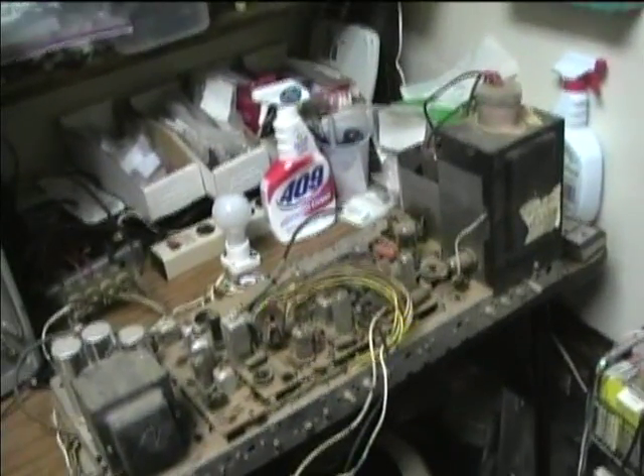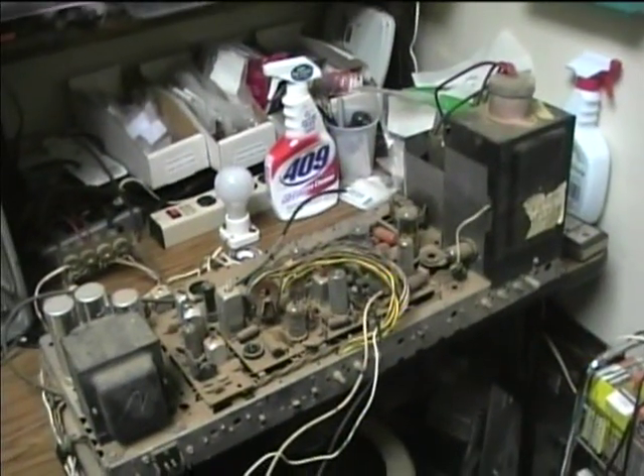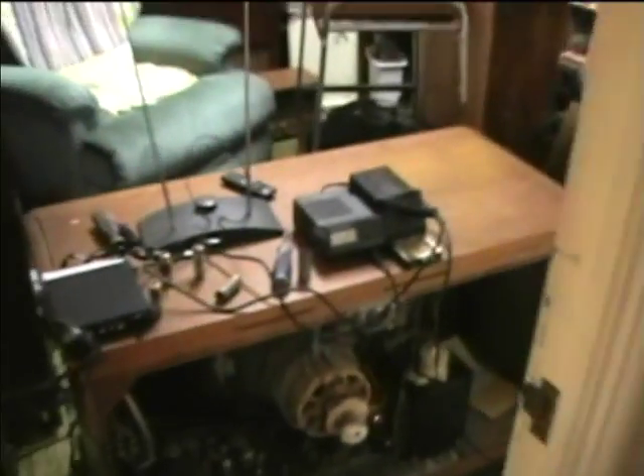Now let's go down to the room where the CTC-28 is and check the performance. Here's the CTC-28 — I'll turn the volume down a little bit. I put in the new coil; the wiring looks a little hokey but I just spliced it in on top of the circuit board, and I used some lead salvaged from capacitors to extend the terminals up to the new coil. I didn't want to damage the coil, and I didn't want to take the entire set apart again.